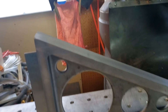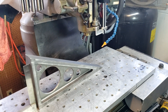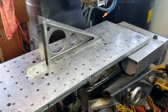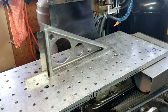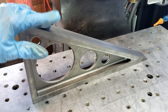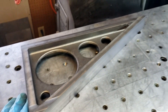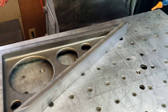There's a little bit at the top. The machine I did it on is this Bridgeport that was rebuilt by J&L Machining in San Leandro. They did the table and the ways, the saddle — pretty much the whole nine yards — hand scraped it in. After that I did the CNC conversion, so I'm sure it's square within a thou or so. It just comes down to your setup. It did seem to flex a little bit when I was unclamping it, so I don't know how square this surface is to that surface — that's yet to be seen. I'll take it over to Chuck and see if there's any way we can grind this. I don't know if he's got the fixture ability, but we'll give it a try.